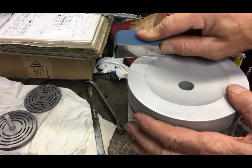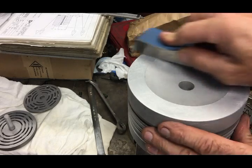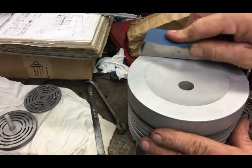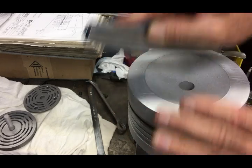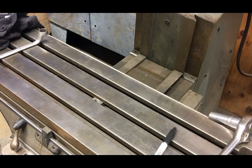I do run a really fine glass media in my blast cabinet, but with aluminum it still leaves a little fuzzy finish - the impact of the glass does give it a slightly rough surface. I was just smoothing it out a little bit.